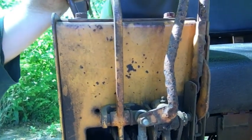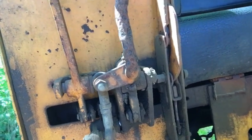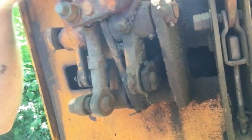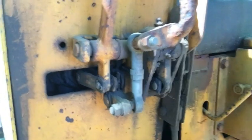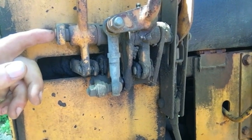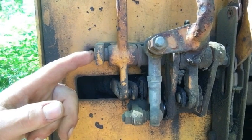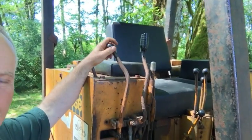I managed to run down another handle for this — it's really badly pitted, and it's got a lot of play. I'm going to replace this handle. This piece right in here is called a crank and it's got a tremendous amount of play; there's a pin in here I'm going to replace. What I'm going to do with this joint is remove it, bore it out, and either build a sleeve or make a larger pin on the metal lathe — just bore this piece out and make a bigger pin to run through here. That should take care of most of the slop.